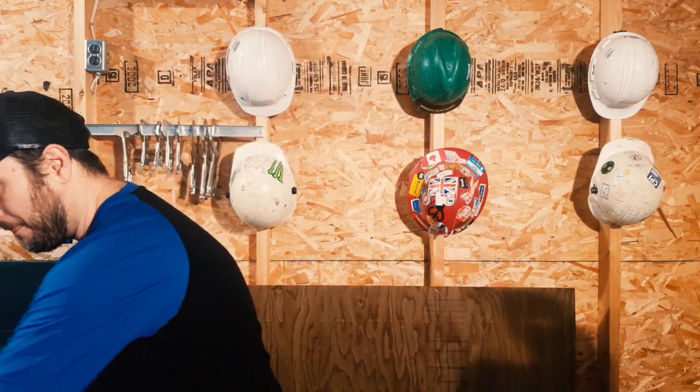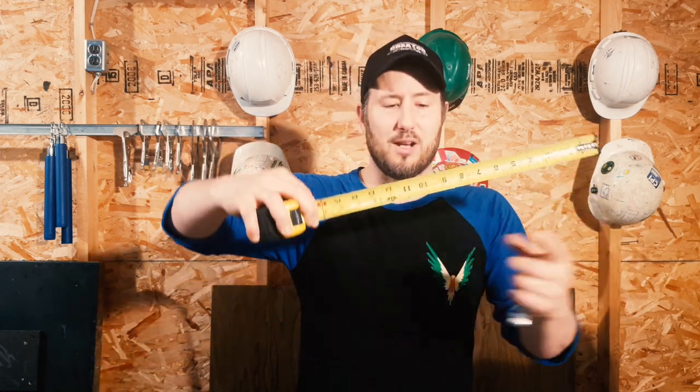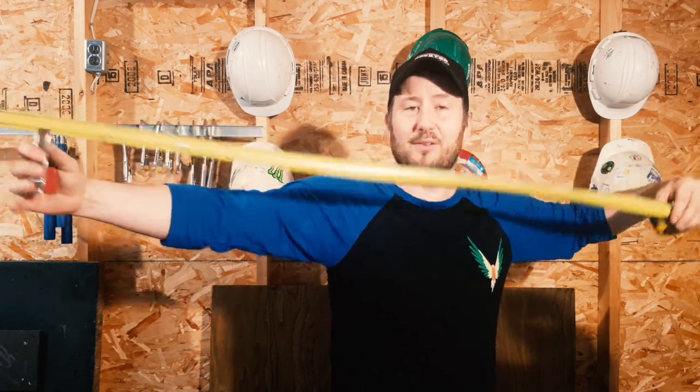Your tape measure — I know this sounds silly — but the tape measure is important. This is an Imperial only tape measure. You don't want a metric tape, and you don't want a dual tape which has metric and Imperial on it. You only want one or the other, because you want to be able to read the tape from both sides of it. The butterfly clip is a very important tool — it clamps the tape on the track while you draw your centers, so you don't have to keep holding one side down. Make sure you have a butterfly clip and an Imperial only tape measure — the 25 foot is perfect.